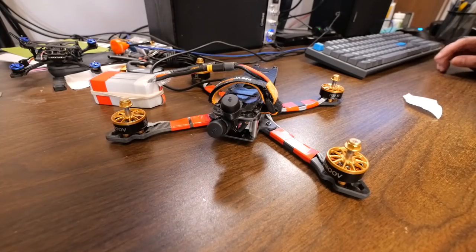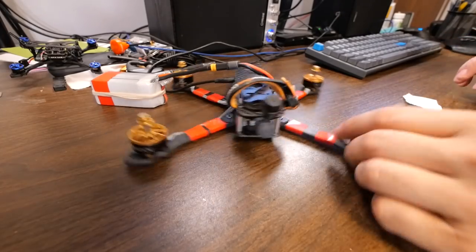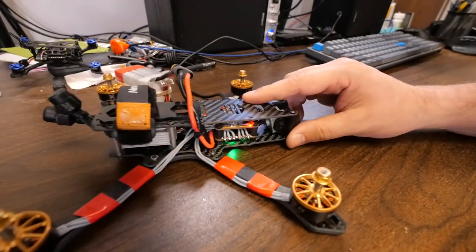One thing you can do to reverse motors is to swap any two of the three motor wires with each other. Now, I don't know about you, but that sounds like a real pain in the butt. If you're real good at soldering, that may be the easiest thing to do. I prefer to do it in software. Let me show you how.